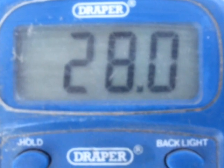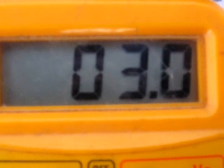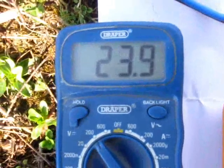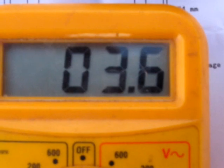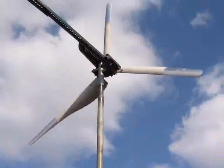I'll complete this video by showing it hooked up to a charge controller. There we are — only 3.5 volts in, and that motor can supply about 7.5 amps. Voltage out: 28 volts, which will charge the battery bank. Started to drop there because the turbine is almost stationary. 3.6 volts in, 28 out.